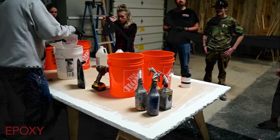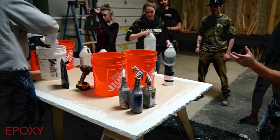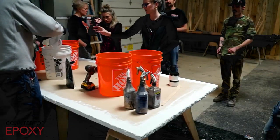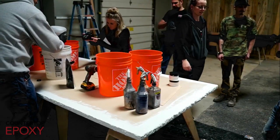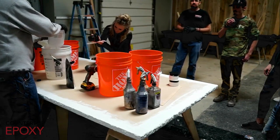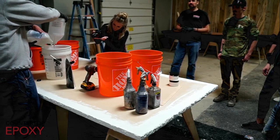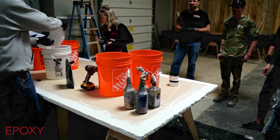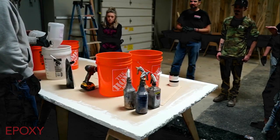So the way that we're doing this one is a little bit different. Earlier today we did the wall epoxy and we did our wood grain tool with that. With this we're going to do our Nouveau. We're going to pour a sheet, like a layer, on our table, and we're going to be using the tool that we made with our trowel, scraping that wood grain pattern into it. And then at the end it will be just a fine sheet, solid on the top, and tomorrow we'll just sand it and uncover a little bit more of those wood grain accents that you're looking for, and then it'll be good to go. It's just a full table. So it is done differently.